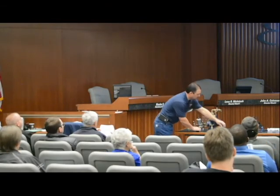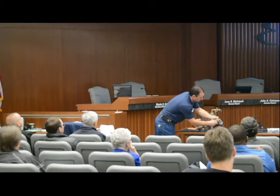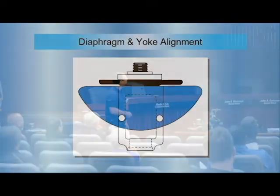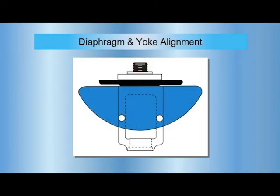On the rebuild, you'll see the cutout — you need to make sure the yoke is aligned so it seats properly. You don't want to drag it, otherwise it can't move up and down and it'll be binding. I have samples up here you can take a closer look at afterwards. That seat on the bottom of the yoke lives right there.